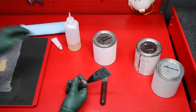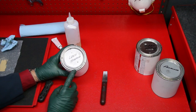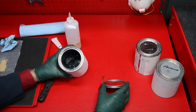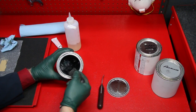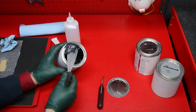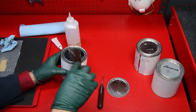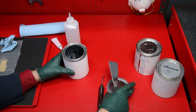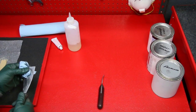Now let's open up the long strand. The long strand is similar to the short strand, but the fiberglass strands are much longer — they're not chopped. Watch the difference when I pull this out: you can actually see the strands, and it really tends to hold together. The strands are much longer and it holds together better than the short strand. You might be thinking: where do you use these and why would you use one over the other? We'll get into that a little later in this video.